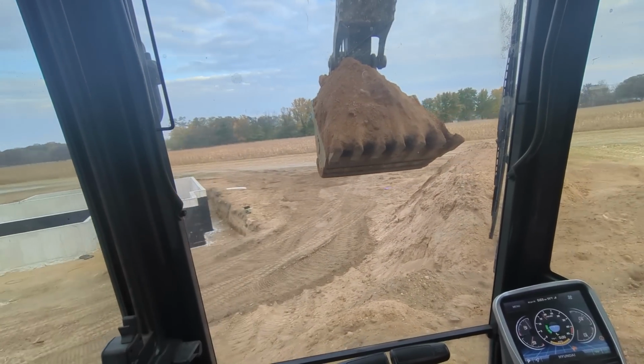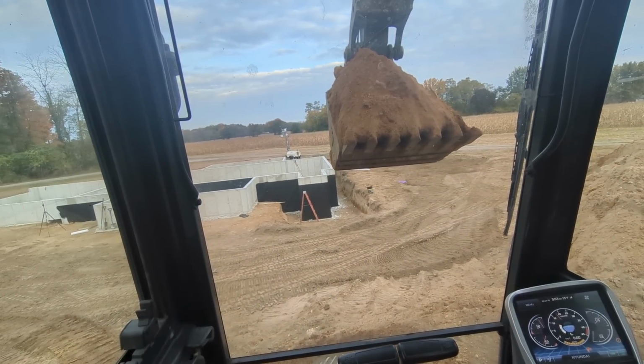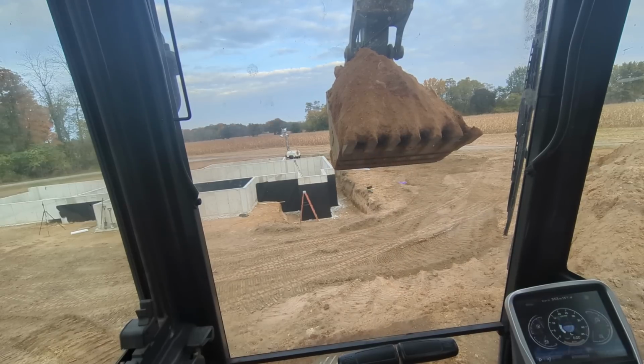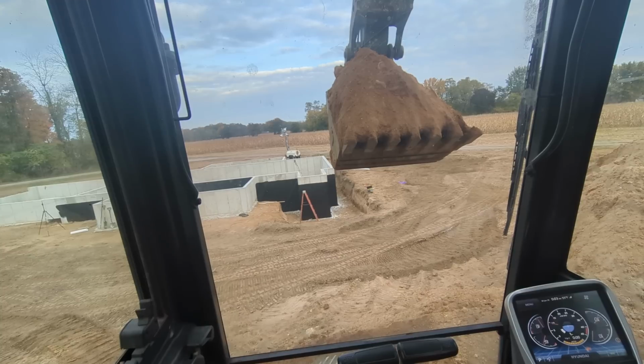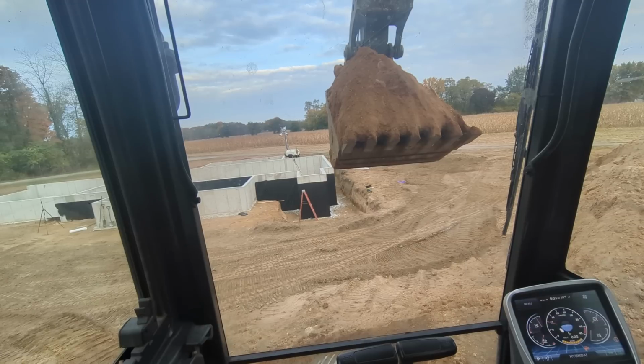We got to hold the foam insulation up against the walls. When we backfill, we're going to be putting 1-inch insulation in, and we're going to be doubling it. And that insulation acts as 2 things. Well, first thing is insulation, and the second thing is for frost. It kind of gives a 2-inch crush zone for frost, so when it freezes and squeezes the basement, it'll crush that instead of actually putting all that force on the concrete walls. And it'll also act as a weatherproofing. It'll keep some moisture away from the walls also, even though we've coated them.